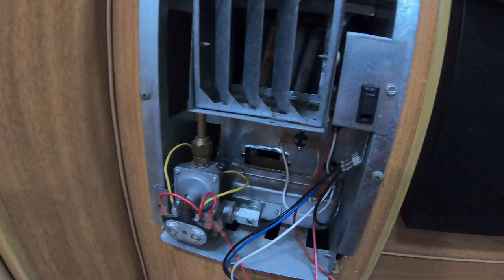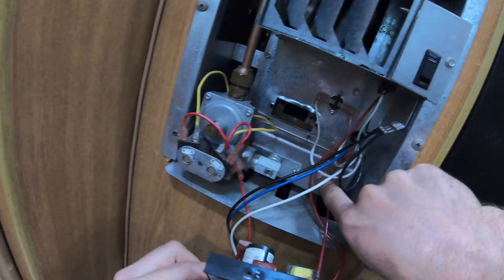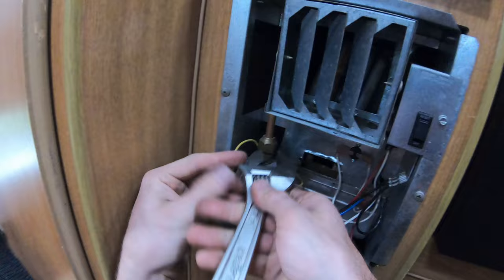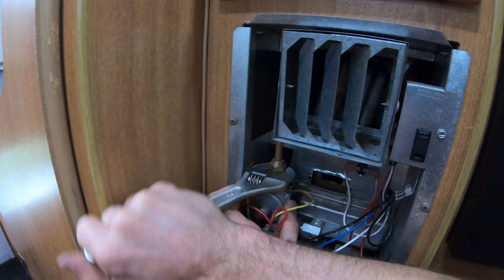At this point I know I'm smelling fuel out there, so I'm thinking it must just be dirt and grime in there. I took out the six quarter-inch head bolts from this whole surrounding plate right here because I'd like to take this orifice tube off right here, but you can see those screws come in from the back side. This is the point at which I am — I'm guessing we're going to find some kind of blockage, a nest, or anything else. Let's find out.